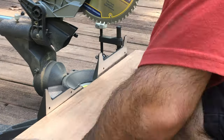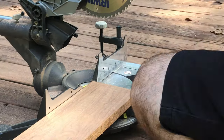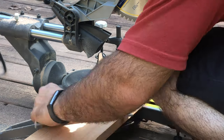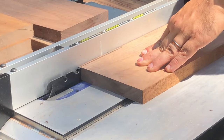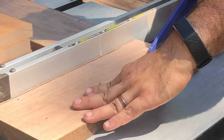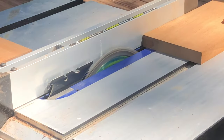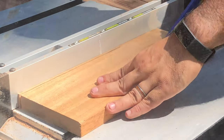I'll be making some edge grain cutting boards out of walnut and African mahogany soon. I'm cutting these to size and we'll run them through the planer to test it out. I could run the pieces through as they are, but I'm cutting the milled edges off the sides to give me a flat surface to start with. From there I cut strips at an inch and three eighths wide. The final thickness of the cutting boards would be an inch and a quarter, so I cut them a little wider to account for the material that will be taken off when I run them through the planer.